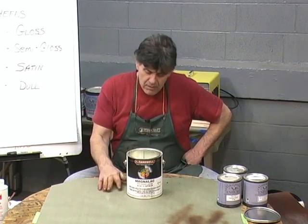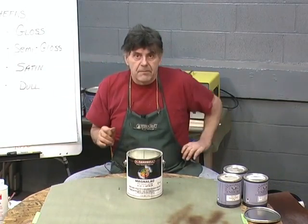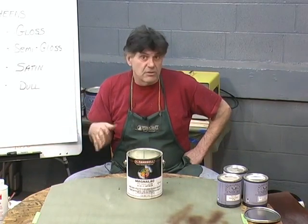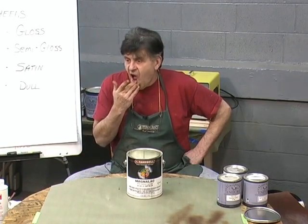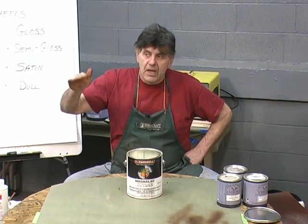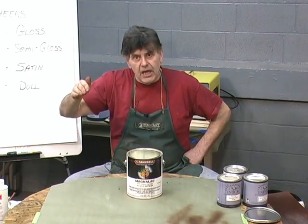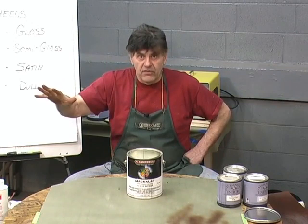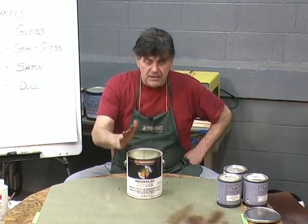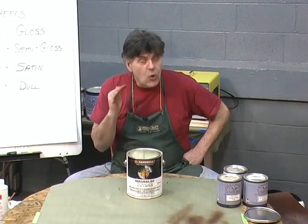Okay, now, heat resistance. There's a thermoplastic in all of this stuff. Nitrocellulose lacquers are probably one of the worst for heat resistance because they'll melt. A better choice would be, you know, oils do pretty good. When we get into heavier film finishes, the pre-catalyzed, as long as you let it cure good before you put heat to it, don't let it get too much heat. And of course, the best is the post-catalyzed products. They are the best. But again, you don't want a real heavy film.